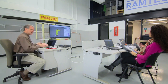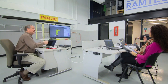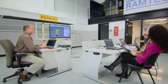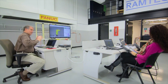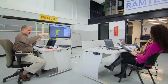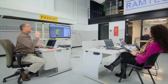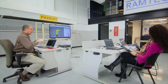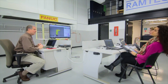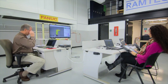It takes a little bit of practice. At first you'll press a key expecting the robot to go left and it'll go right. Regarding pressing multiple jog keys simultaneously — you can in joint mode. You can even press four at once and see the arm do all four joints. You've got to be careful in world mode, as it may be an impossible movement and you'll get a little error at the top saying it's not an acceptable movement.